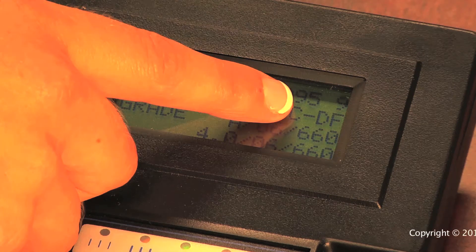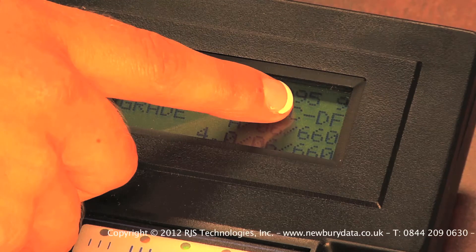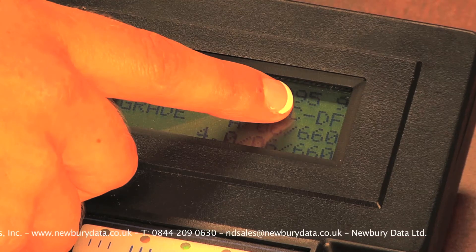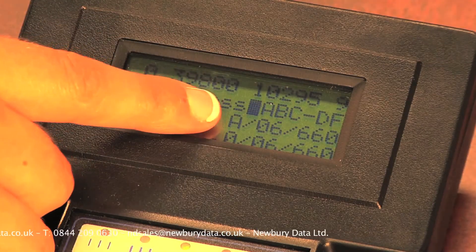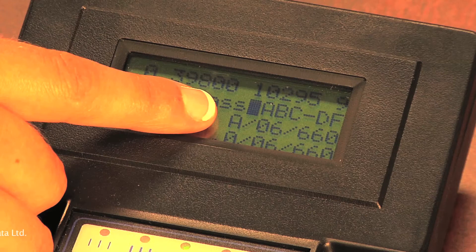On my unit, the minus is between the C and the D, which is set to allow passing any barcodes graded A, B, or C, and failing any D or F barcodes. For the third line on the LCD will be the ANSI letter grade result. You will notice that for my barcode, I received an A grade.